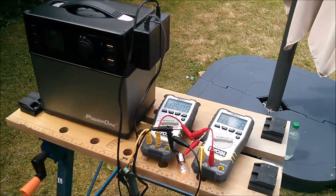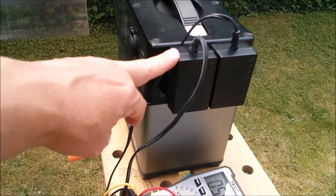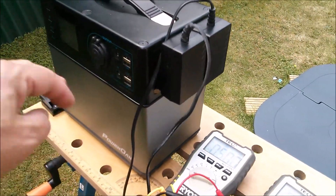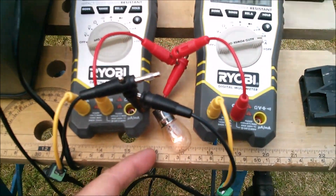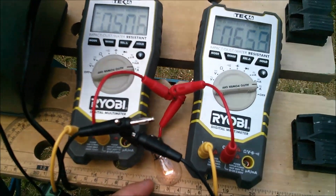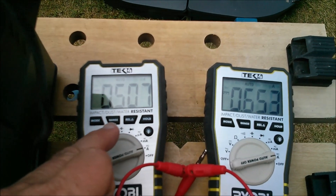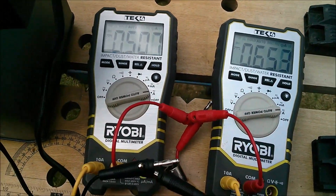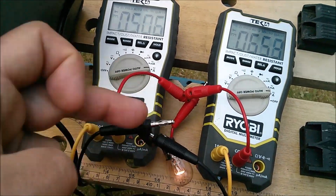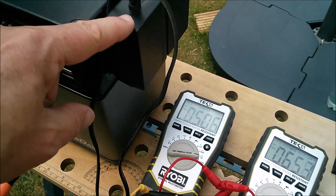Power supplies in parallel — got two five volt PSUs in the two main outlets of this power unit, and they're driving this 12 volt bulb. It doesn't really matter that it's 12 volts, it's just a little bit dim. The current sharing is pretty good: we've got half an amp on the left and 0.65 on the right. This is all just paralleled up, but I just wondered how twitchy these things would be.